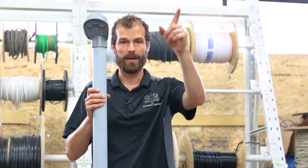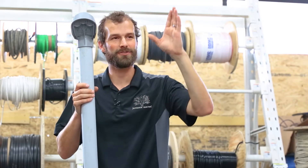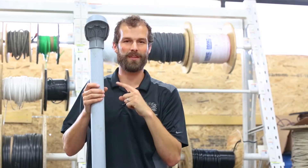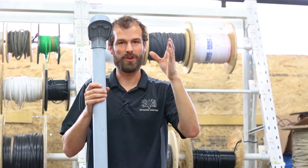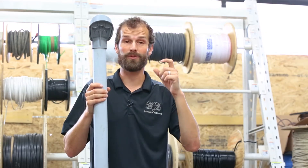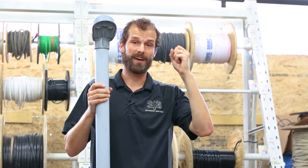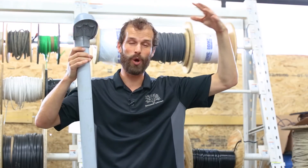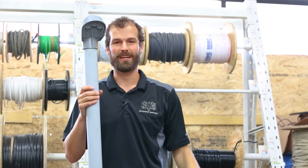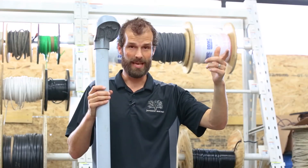The utility drop must have a clear line of sight from the utility pole to the weather head — there cannot be obstructions. A customer's pine tree was sitting directly between the utility pole and the weather head. That service drop rubbed on the pine tree for probably years, eventually rubbing through the insulation on the conductors. It smoked and popped inside the pine tree for a couple of hours before it burned itself free, scorched the side of the tree, and fell live into the customer's backyard. Foliage obstructing the line of sight is the customer's responsibility unless it's in the utility right-of-way or easement.